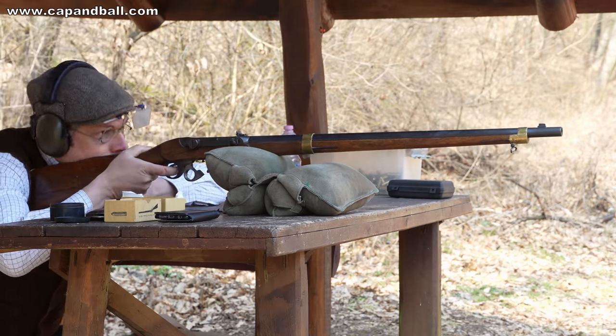The caliber of the rifle is 14.85 millimeters. It has a 6-groove right-handed rifling, and the twist rate of the rifle is 213 millimeters. The diameter of the chamber is a bit larger, it is 16.3 millimeters, which means that you actually need the paper to be able to tightly fit the bullet into the chamber and to have it completely aligned with the axis of the bore.